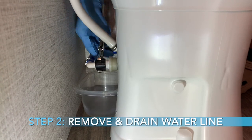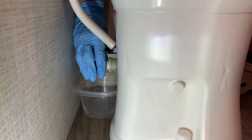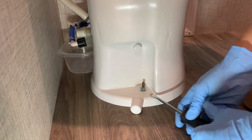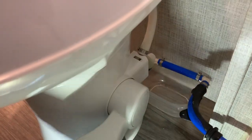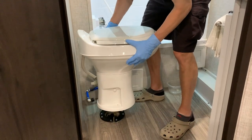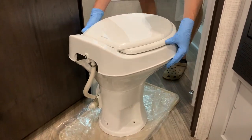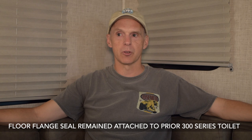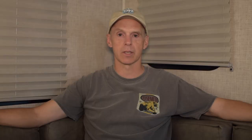Here are the steps to remove the toilet. First, turn off the water supply. Second, remove and drain the water supply line going to the back of the 300 toilet. Third, remove the toilet bolt cover nuts and washers — use the screwdriver to pry the covers off, then the 11mm wrench to get the nuts and washers off. Fourth, pick up the toilet from the bolts and it will come right up pretty easily. You can also remove the floor flange seal and T-bolts if needed, though that's not always necessary. Once the toilet's off, clean the floor flange with your rag and get ready for the new toilet.